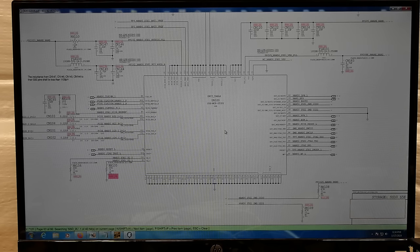The first thing I'm going to do before I install all these components is remove the original NAND from the board. The reason I'm doing that is because removing that NAND requires not using the preheater due to how much pressure we have to use to remove it because of the underfill that's used to secure it to the board. We also have to heat the board up to pretty high temperatures — about 380 to 400 degrees Celsius — which could cause the components installed using leaded solder to melt and come off while we're working. So the first thing is to remove the original NAND, then install the missing components and the two new NANDs.